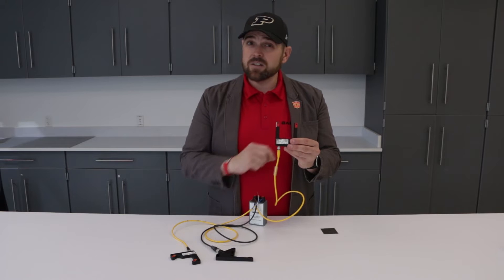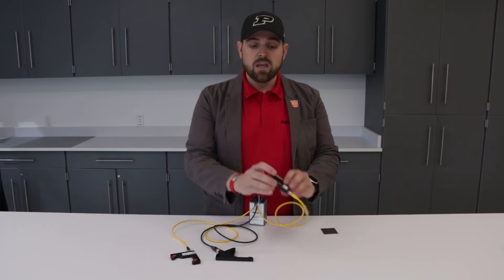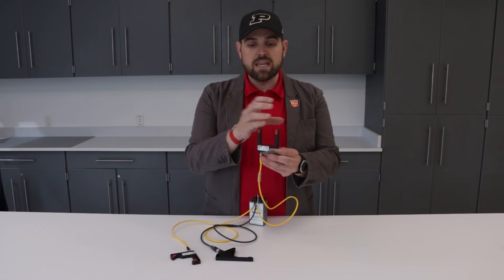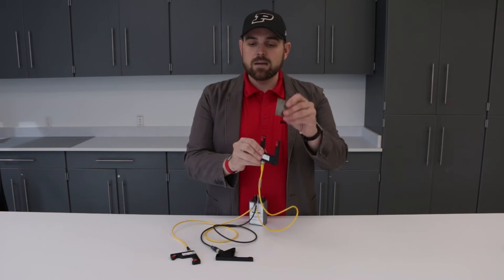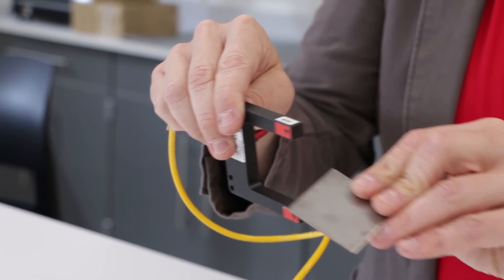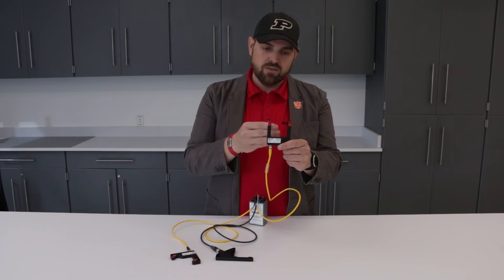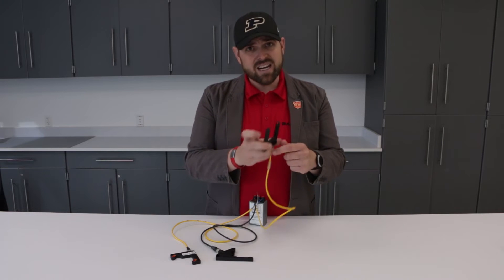Something you have to know about these is there are a lot of different light sources, so I'm going to talk about some of them today. The first is the red light, which uses a diffuse beam — a beam that spreads out — and it's the most economical technology. It can detect parts down to about half a millimeter in diameter, and it's available in all the L frame, the fork sensor, and different housings. It's the most economical version.